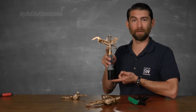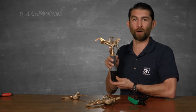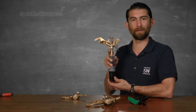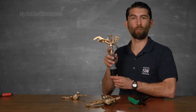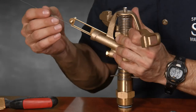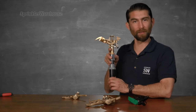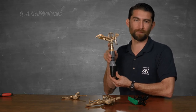This Hendrickson pressure regulator has the added benefit that it will not allow water to flow through it without having something restricting the water attached to it, like a sprinkler head. So if someone swiped one of your sprinkler heads or it got knocked off, the water would stop — as opposed to not having one of these, where the water would flow unrestricted, flooding your field and wasting a ton of water. It also means you could unscrew the rotor and work on it without having to shut off the water. Rotor clogged? Unscrew it, clean it out, screw it back on — you're back in business without interrupting your watering or having to walk back to shut off the valve.